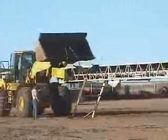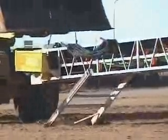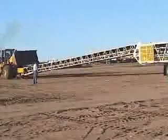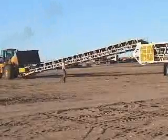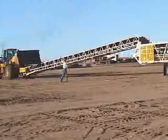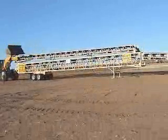Starting on the head section, hook a lifting chain through the lifting eyes and slowly lift up off the support legs. The pins can now be unpinned and the legs can be put back into the transport position. While keeping the head end lowered, begin to push in with the loader. Once the section has been moved out of the connection point, the section needs to be lifted up for clearance. Once the section has been pushed back the entire length, it can be lowered onto the main truss.